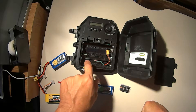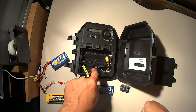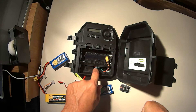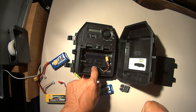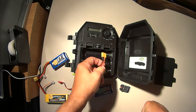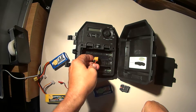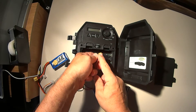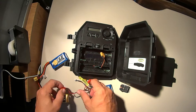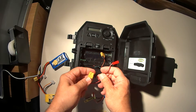The main mod: you just have to take out a couple of screws, go in, and you'll see where the auxiliary plug connects with the batteries. I just soldered on these two wires — that's all it takes. Make sure you get the positive and negative correct, especially on the XT60 plug. The positive is always on the flat side. JST is pretty easy — it's red and black, can't mess that up too bad.